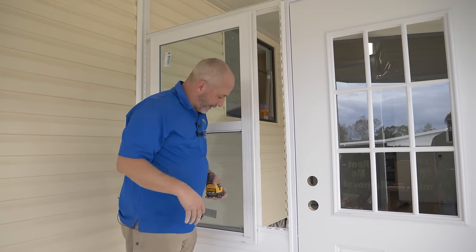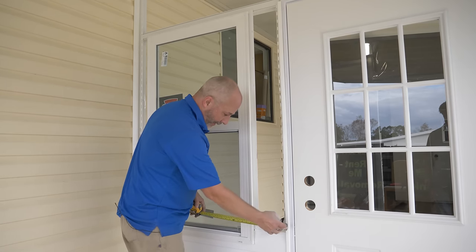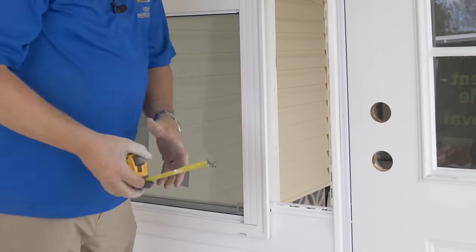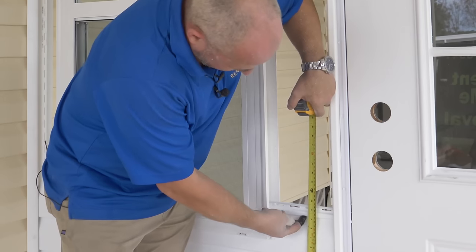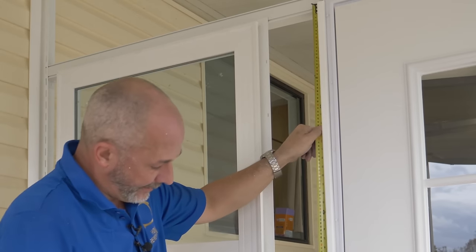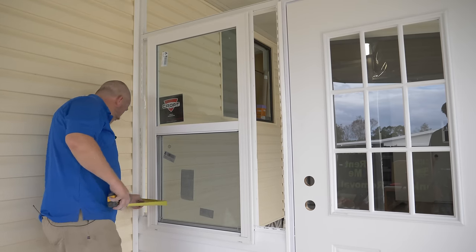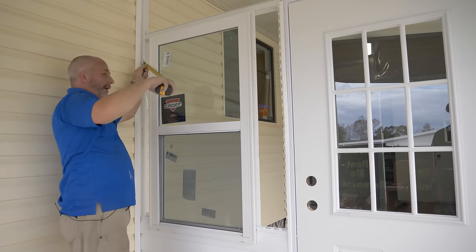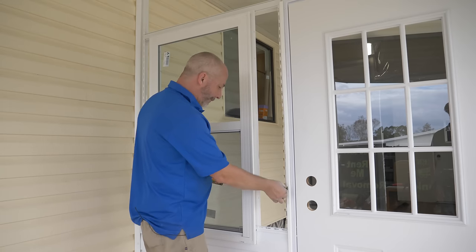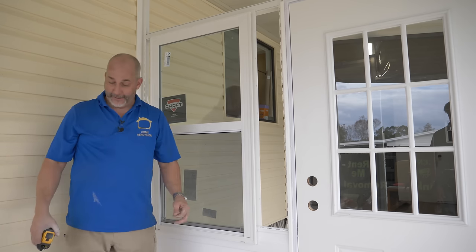This is where the production element comes in. We want to do a bunch of pieces, and if we built this right, they should all be about the same height, same length, sorry. So we're looking at giving it a little bit of room. 8 inches is perfect. Now each piece of siding goes from rib to the bottom, so 9 inches. So let's see how many pieces we need. 9 goes into 47, 5 times. We'll do 5 times 8, and then this one is 5 inch. Love making things square. So 5 pieces at 8 and 5 pieces at 5. Wow, let's get to work.